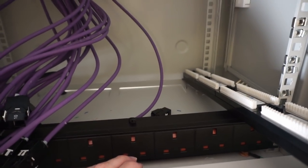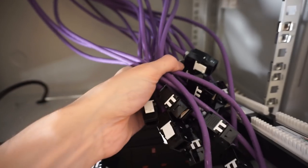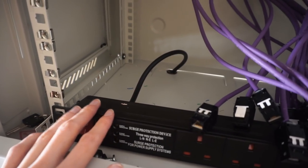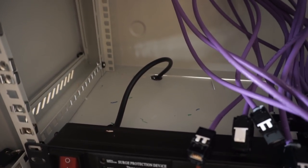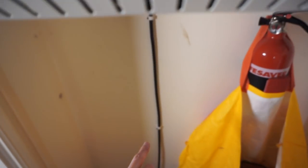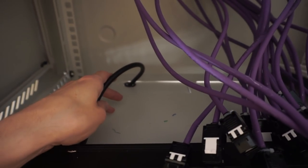So that is basically all done. So the next thing is to get the cabinet out. The only other tricky thing we have right now is this PDU. Because when I installed the PDU, it's a fairly cheap one, it's not got a replaceable cable, it's just got a hardwired flex. So what I ended up doing was basically taking it apart, wiring a new flex on inside it, mounting it in the cabinet, and then running the flex around the room, or around the cupboard, and when I got to the other end with a plug, I cut the flex to the right length and wired a plug on. So it means that essentially this is currently kind of wired through the cabinet.